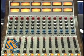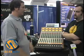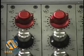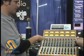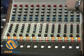Basically, it's based on a 12-channel system. You can have anywhere between 12, 24, 36, 48, or 60 channels total. So this is one of the 12-channel buckets. The main thing about this console is fully balanced — the summing buses are all balanced and the aux-send buses are all balanced, which is a big achievement. A lot of the Class A discrete consoles made like this didn't have a balanced busing scheme, so the busing was a little noisy.